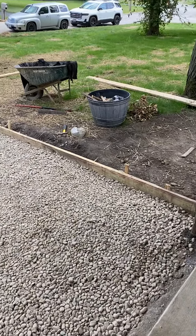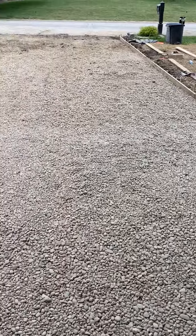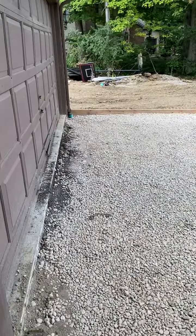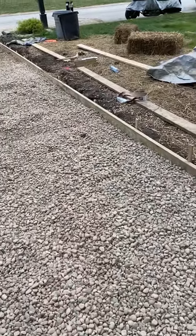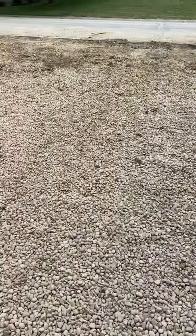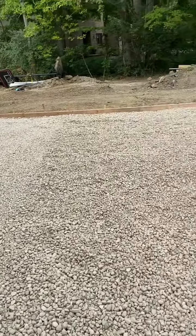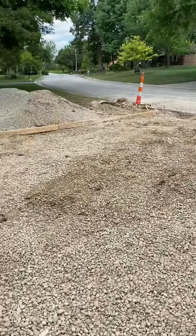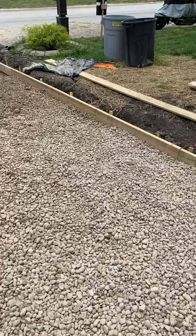I was asked to do a video about what we need for concrete. I'm going to start here at the driveway. We've tamped some of it down and got most of it to grade, but there's still some spots we'd have to work on. You can see where we ended the tamper. We've got some rough spots down here, but we'll be filling that in. We've got the gravel, so this can be done in like a half a day.